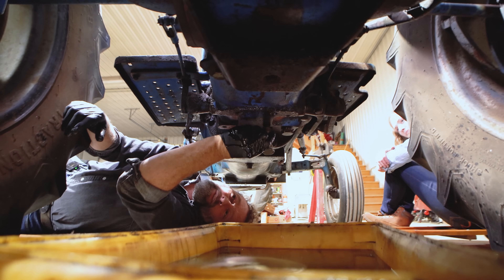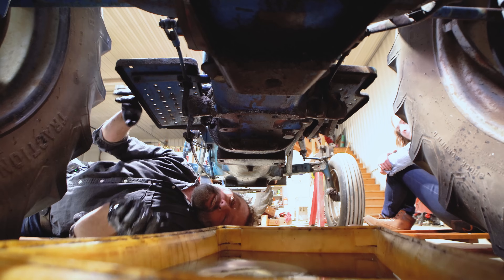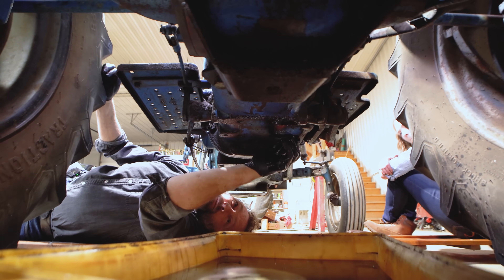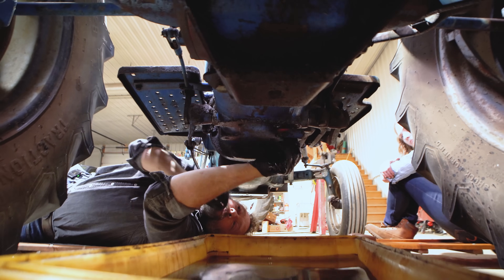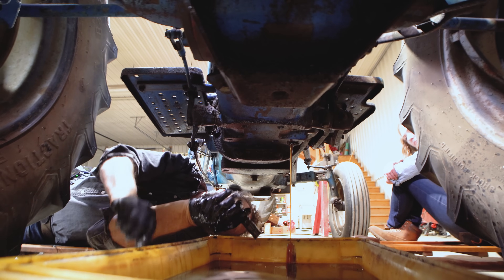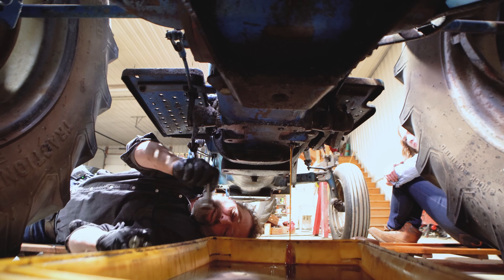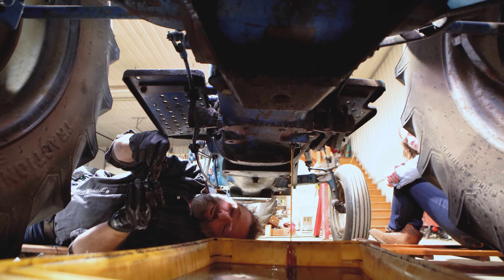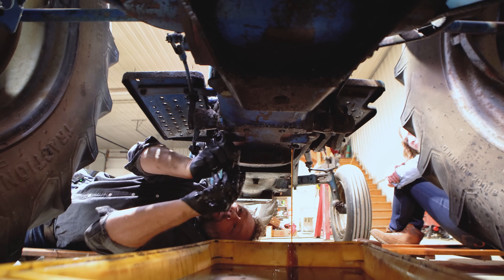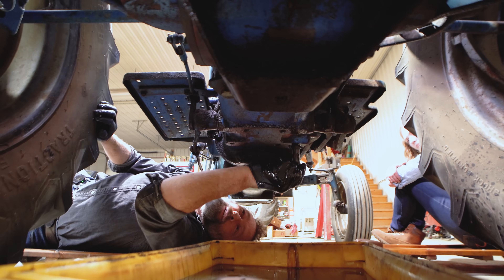On the bottom of the tractor is the actual relief valve itself. It takes a one-and-three-sixteenth-inch socket to get it out. Take the relief valve right out of the tractor — there's the old relief valve — and we sell a new one. Stick the new one in using a one-and-three-sixteenth-inch socket. Put the washer on first before putting it in.